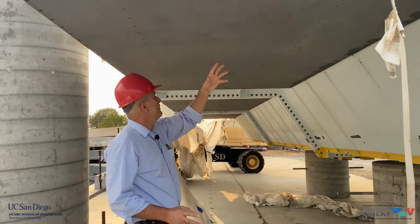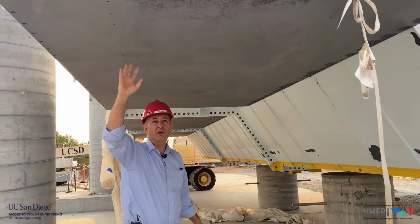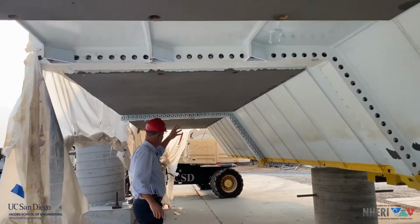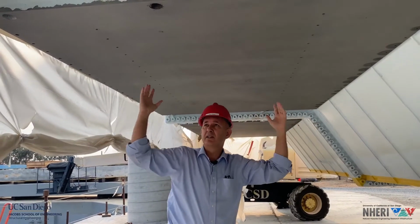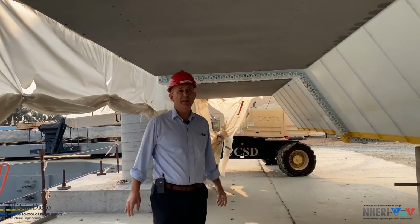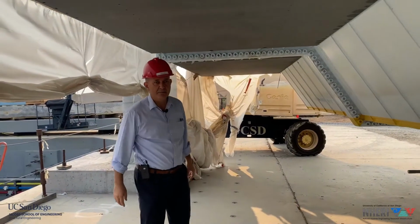We are going to go under the platen to show you the surfaces over which the top of the vertical actuator will slide. You see these surfaces had rusted in the last 15 years; we just grit blasted these areas. And you see the one in the middle here. There are 3 on each side. We are going to install some very large, half-inch thick wear plates, highly polished, and we will have to maintain a planarity of plus or minus 24 thousandths of an inch on each of these 6 areas.